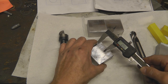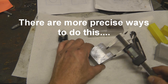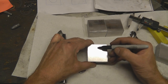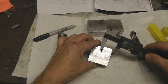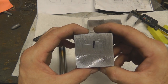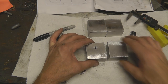If I do the same thing I did before, make a mark like I did — right there is where our center of our hole is going to be for this particular block. I'll mark each of the remaining three blocks the same way. And when I put them in the mill vise, I'll show you exactly how we're going to center them.